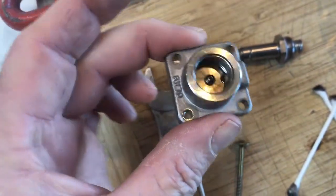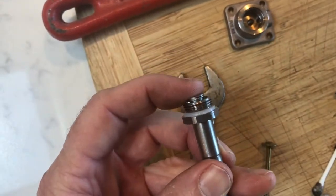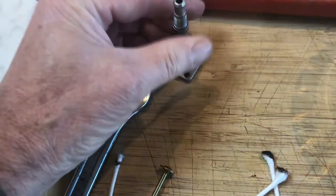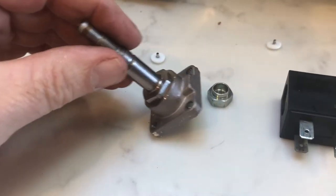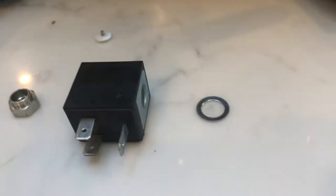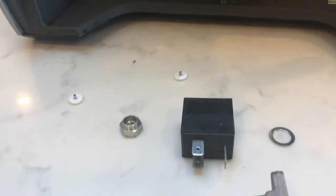So that's our base pretty clean now. We could acid wash that, but I'm not going to bother — it's clean enough. Here we've got our plunger — look how nice and easy that goes in and out now. All we're going to do is make them back up. We'll tighten this back up and put the other bits back in. This is all tightened on with pliers. We've got to put these little pins back in the two holes, and then reassemble our relay. The washer goes on first, then this, then the nut, and these two little things — and we're good to go.